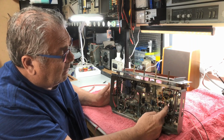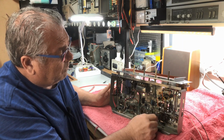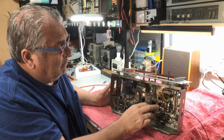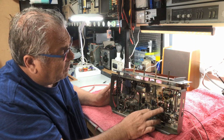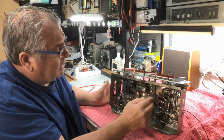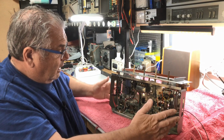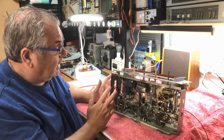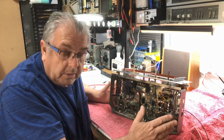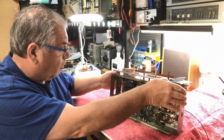We've got an AM aerial coil here. The oscillator trimmer is up here, but shortwave, I'm just not real sure at the moment what this fella is. There's a slug to tune on this one, so I've just got to work out what is what here. Otherwise, everything else is looking pretty good. The radio is performing unbelievably. It's incredible. It's a very, very good performer.